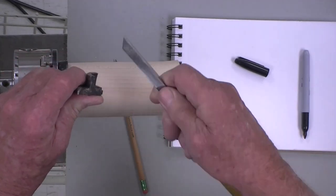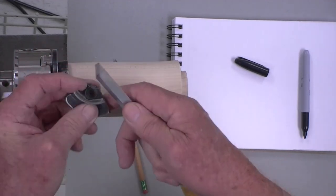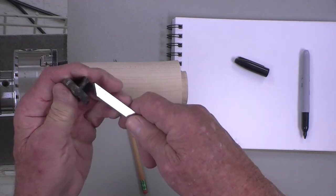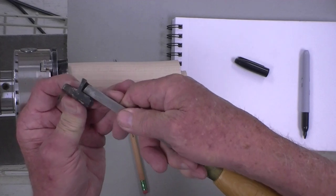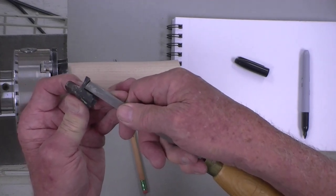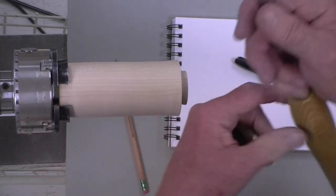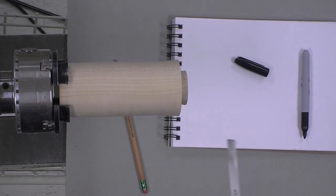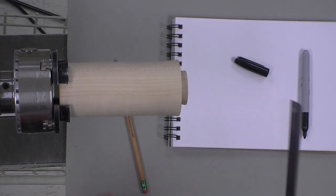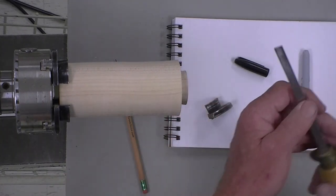Can you see that? I've got it cut about 7-8 degrees, so it fits right into there. You see that? And all I have to do is come in from the side and do a shear or scraping cut and go right down to that size that's real close to the closing of those jaws. Follow me so far?